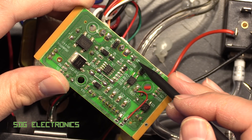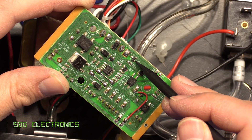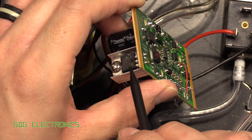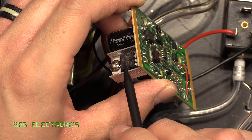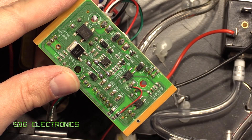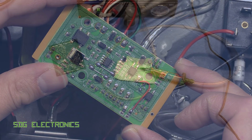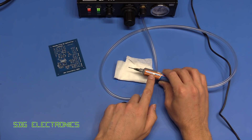The solenoid is driven by just a tiny SOT-23 transistor. What I thought would be the switching transistor turns out to be an LM317, and there's also a 12-volt regulator on the board — nothing too surprising overall.